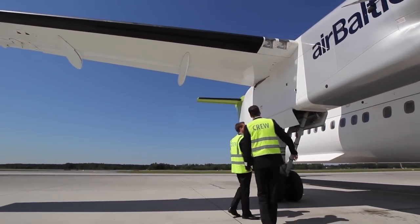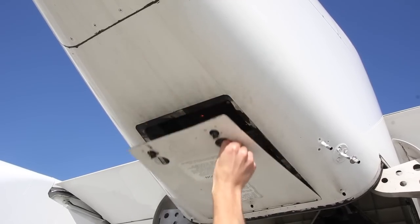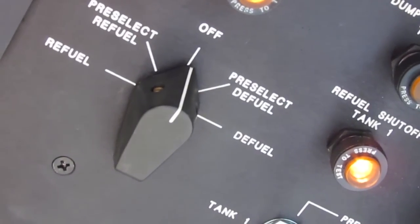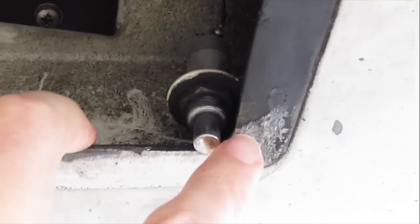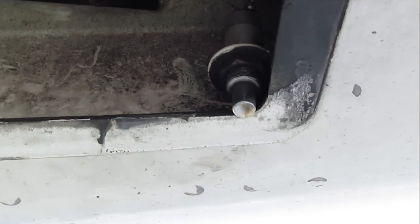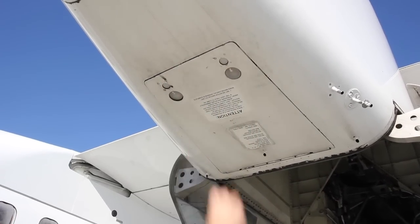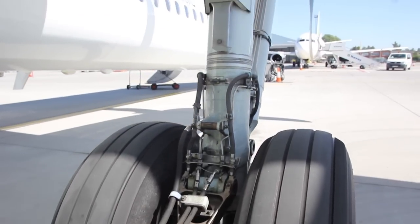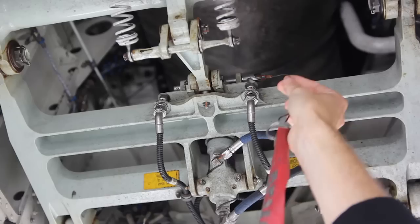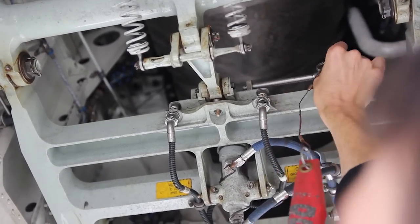Moving back to the engine area, we have the refuel panel door where we can check the refuel/defuel selector switch is in the off position. It is quite a dirty area which can lead to problems with the micro switch that detects when the door is open. If the fueler has problems starting fueling, give this micro switch a tap or a push and the panel should activate. Moving under the nacelle and into the gear area — the first thing to check is that the gear pin has been removed. After a night stop away from base you will also need to remove them.